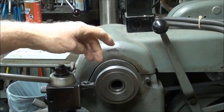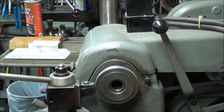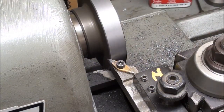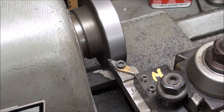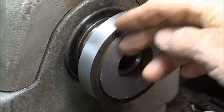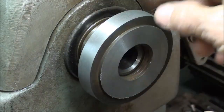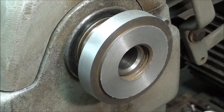And I'm right on. Now while I'm still working on this periphery I'm going to reset the tool and make a nice chamfer here on the backside. I'm cutting a nice healthy chamfer on the backside here using the backside of this triangular tool. To my liking the whole casting is a little too thick here where I have my fingers, so I'm going to machine this surface off. Little Machine Shop calls this the registration boss. I'm going to face this off so it's clean and take just a little bit off to reduce the thickness, and then I will machine a new registration boss on it to fit my own chuck.